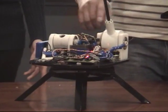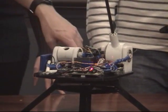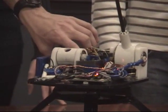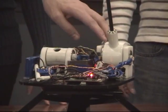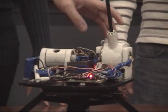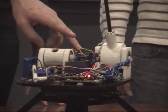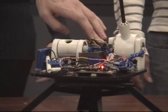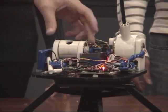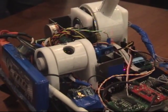We 3D printed the gun pod and the camera mount. The azimuth drive is a continuous rotation servo connected to a gear drive mounted to the base — azimuth being left and right. The gun pod also uses a continuous rotation servo with an additional potentiometer mounted on it, giving us gear reduction so it moves slower. The camera pod is moved by a standard RC micro servo.